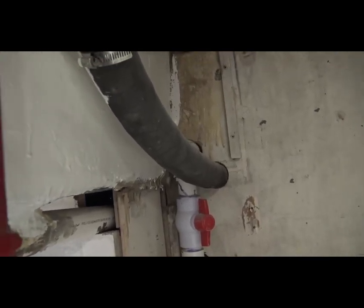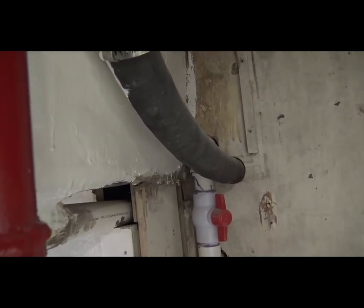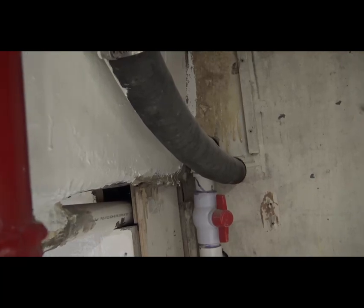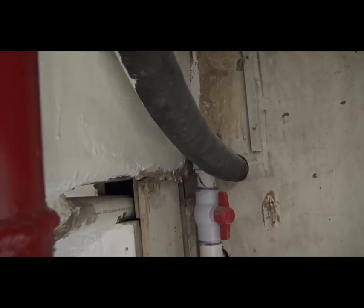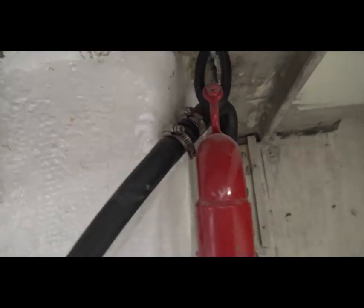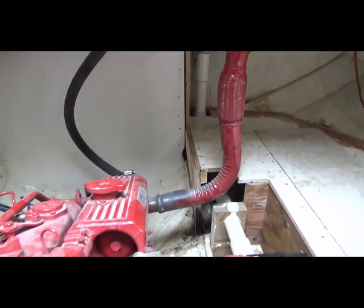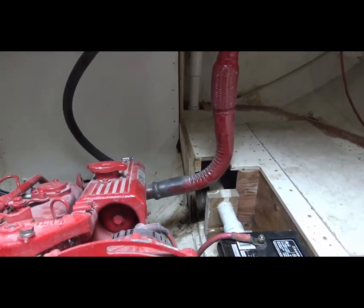So it's the same thing when you shut the engine off. There's no residual water, like as if you would have a water lock muffler and stuff like that. They always contain some water. It depends on how the boat is moving. It could back flush into the engine. And I didn't want that.